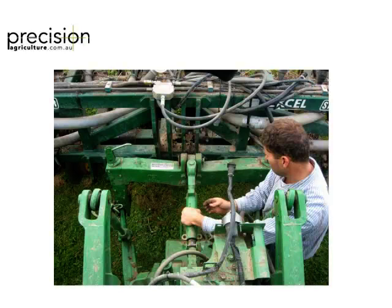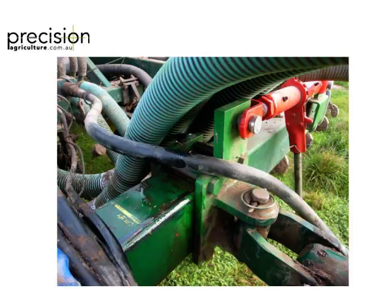If you buy a 3-point linkage planter, get them to get multiple hitch points on there. And this guy's only got 2 hitch points, so he can offset inter-row sow on this machine. This is an XL single disc again. He then has a little, where your air seeder pull is, you just got a little ratchet there just to make it easier to move across. Undo those 4 bolts, ratchet it across so that your air seeder pulls in line, because you don't want to move your planter and then have your air seeder not pulling straight. It'll pull the seeder around.